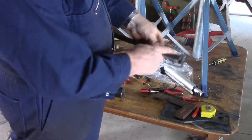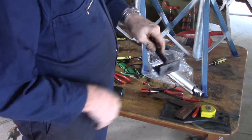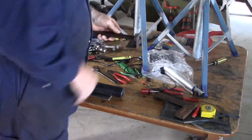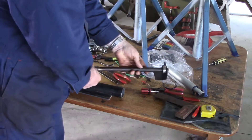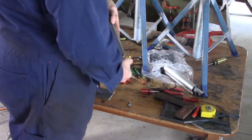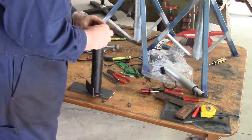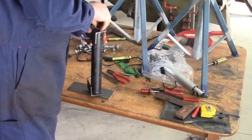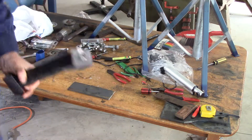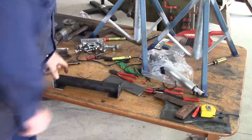Now I'll explain what I'm doing here. I've got the axle — we threaded it before for these bolts. Put the bearing on this end and the angle on this end and got it all bolted down tight, so that bearing still spins in there. We've got a small gap, about half a millimetre between the angle and the bearing — that's plenty of clearance. Then I take this bolt out and slip it through this end and bolt the angle on the other end as well. Get everything lined up correctly, put this on this end with a ring washer, and tighten the bolt down. There she is assembled as it should be — the bolt's holding that in and these spin freely. There's our roller.